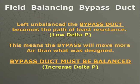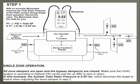Now we need to balance that bypass duct. If you do not balance it, more air will move through that bypass than what was designed. So what we're going to do is create static. How much static? Let's take a look.